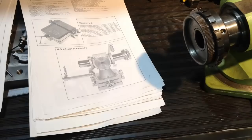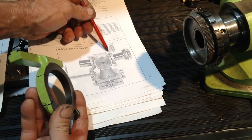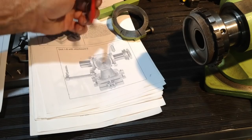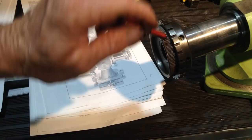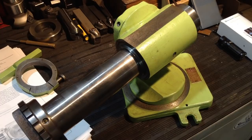Well, the clamping arrangement is the same and the body of it's the same, but instead of the dovetail arrangement, we'll build up this detent arrangement here. So we can detent into the slots, which on our one here are here. And they just turn around, actually quite a nice fit in that. Remember, in an earlier video we lapped all this lot just to get that perfect fit.